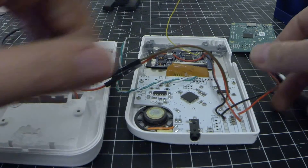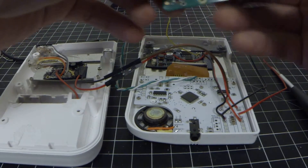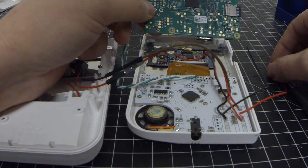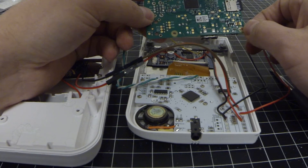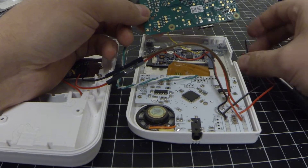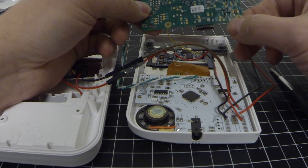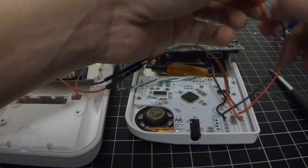It's all the little things, and once you do all the little things, everything comes together quite nicely. So on the Raspberry Pi 3, the power is going to be PP2 or PP1, and then the ground is PP5. So let's get that soldered on real quick.